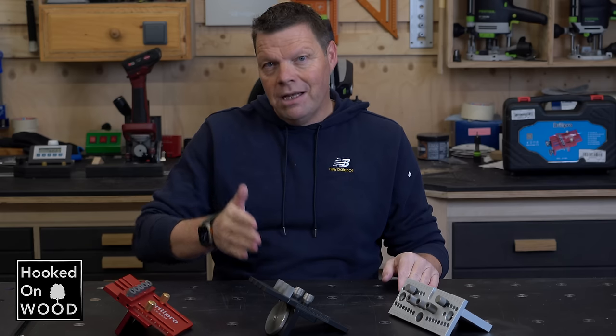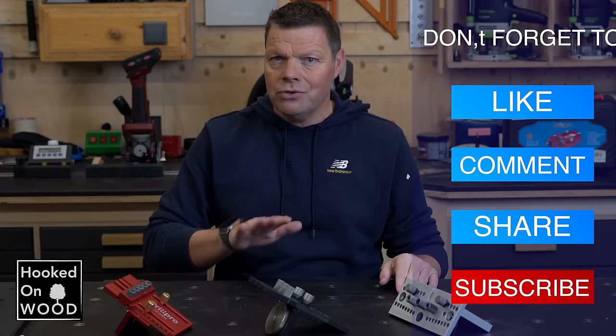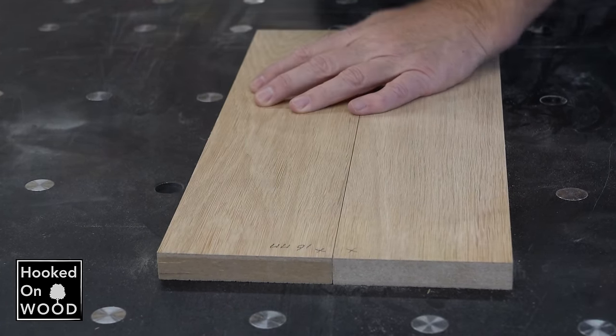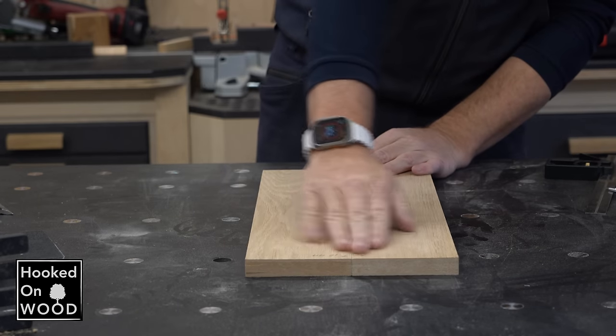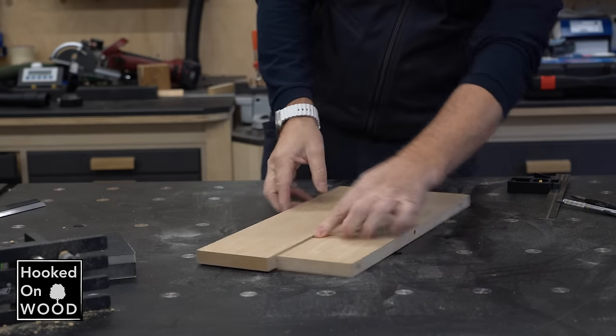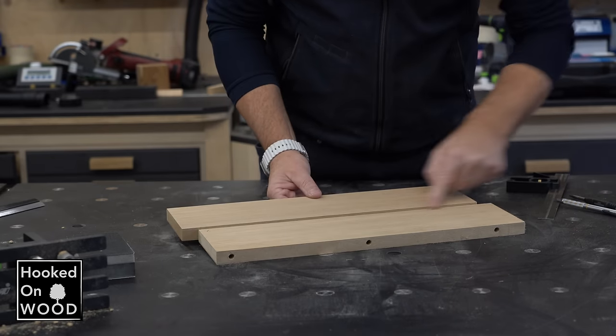The answer to that question is no. Just because you can place the dowels precisely in the middle doesn't mean you don't have to consider which side you want to align the workpiece. If you want two sides aligned and set your doweling jig to 16 mm and drill the holes, in the end it is still perfectly aligned. Only when you turn one piece around is it no longer aligned. But there was a reason we wanted those two sides aligned anyway, so it does not make sense to flip one side. Besides that, this would only work when the dowels are spread evenly over the length of the board, and because you start at one side, the chance that your first and last dowels have the exact same distance to each end is not apparent — meaning the board will not align in length.